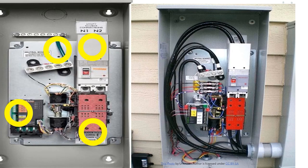If we look over here at the one that's been pre-wired, you can see this all play out — on the top side they have the utility conductors, on the bottom side they have the load going back to the customer's house, and then they have the generator cable feeding the generator. Just some basics today to get our feet wet into how the automatic transfer switch works and how it looks when wired.